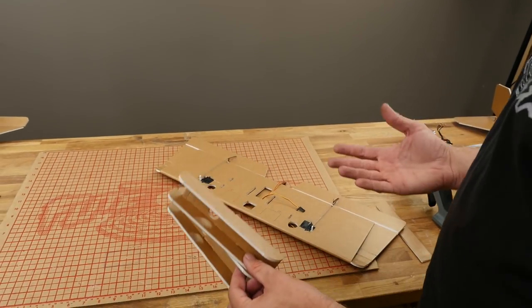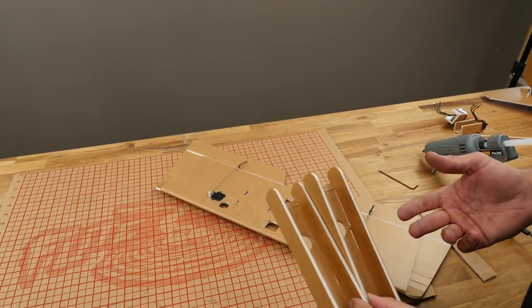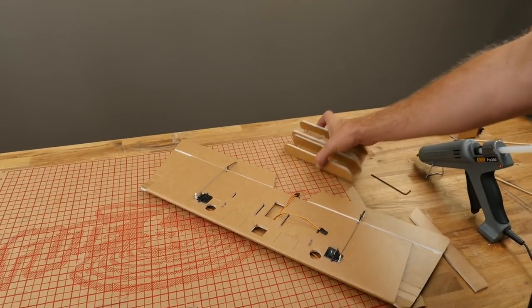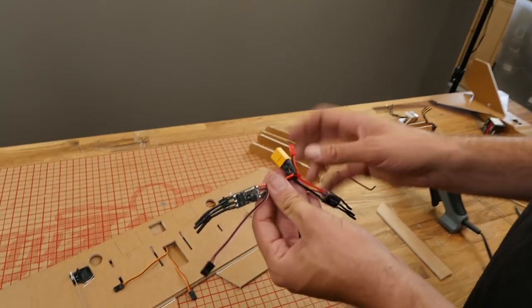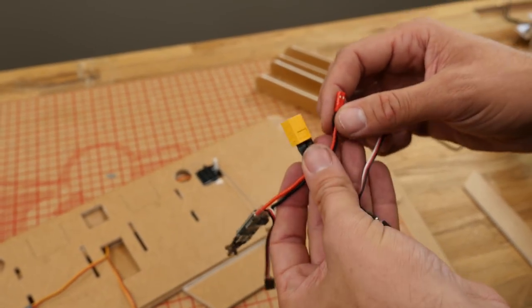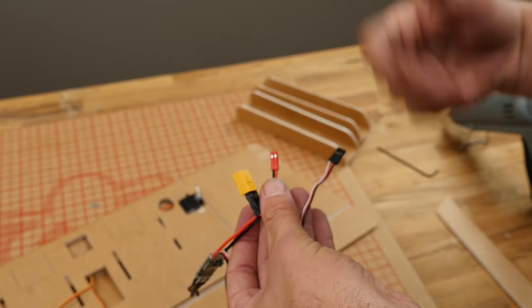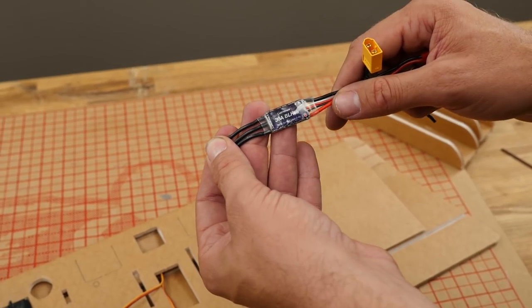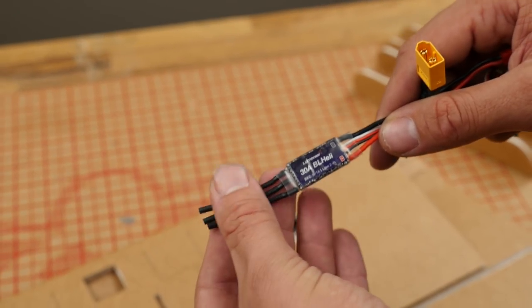We're going to go ahead and get ready to put these on the wing. But first, let's route our ESCs now rather than a little bit later, so we don't have to try to pluck them out later. We've already soldered this, and I put a little lead on here so I can power my video transmitter when flying FPV. But if I want to fly line of sight, I can unplug the whole thing and take it off. We're using 30 amp BL Heli one-shots from Lumineer along with our Emax red bottoms to give it a lot of speed.